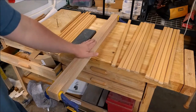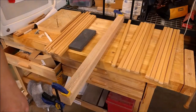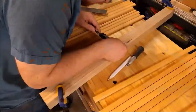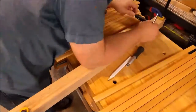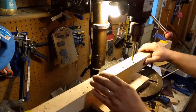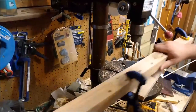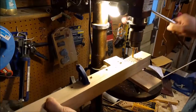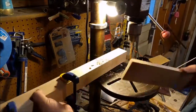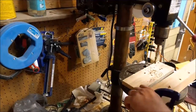Now I'm going to be drilling this piece in one block since my drill press has the depth for it, so I only need to measure and mark once instead of on two pieces. I'm measuring every three inches and then a half inch away from the edge, marking it with an awl to help the drill press drill in the right spot. I really should have done some pilot holes first to make sure they were placed correctly before drilling all these holes with the dowel-width drill bit, but I didn't and I suffered from that. As you'll see later some of these holes are off quite a bit, though I managed to overcome it.